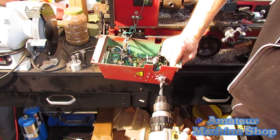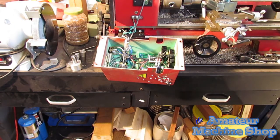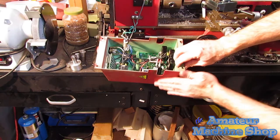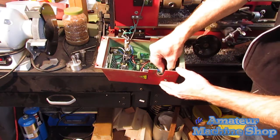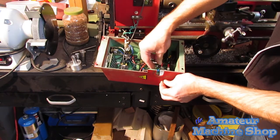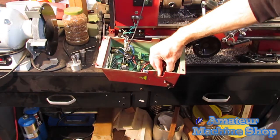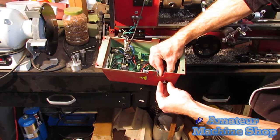Again, I eyeballed the location. You have the option of being more precise and taking measurements. I had already fitted the circuit breaker with the connectors, and the threaded round nut is removed. Feed the threaded end through the hole and thread the nut back in place. Using the steel and plastic nut, the distance that the circuit breaker sits proud can be adjusted to your liking.